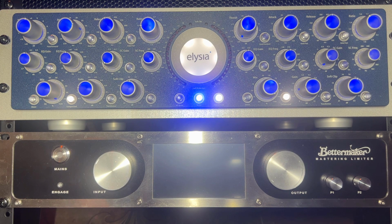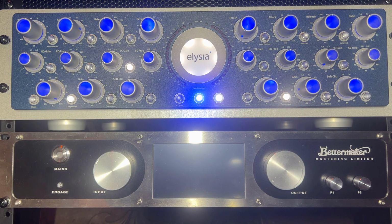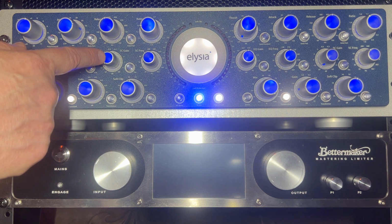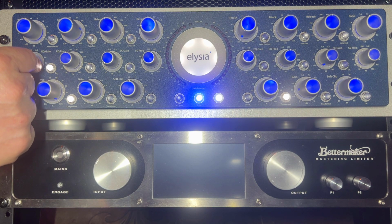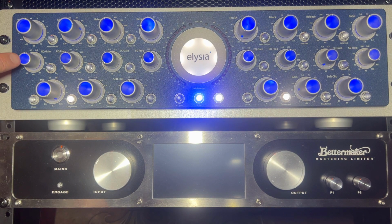The Alpha's second row of controls activates and shapes separate filters for the audio path and internal sidechain. The sidechain filter for each channel, left and right, or mid and side, can be bypassed or adjusted to provide either a high pass filter or a low one with a corner frequency between 30 Hz and 3.3K. Only the sidechain control for the mid channel is active in linked MS mode. The defeatable audio path filter for each channel fashions an inverse action shelving type curve when activated, either boosting above a user-selected corner frequency while simultaneously cutting below it, or boosting below and cutting above, according to cut control settings.